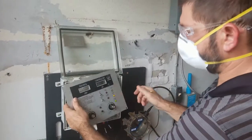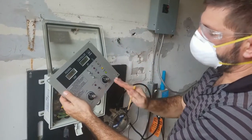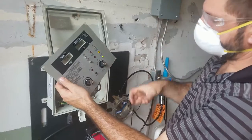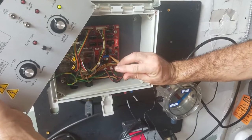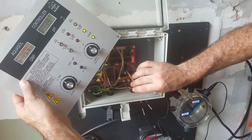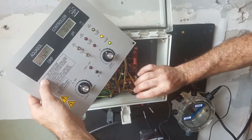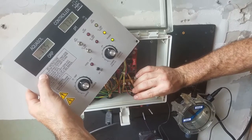The first thing we're going to want to do is adjust our knobs to match what we tested in the pool. So if straight up and down we want to be at 7.5 pH, that means a little bit higher here would be our 7.7. So then we're going to go into our potentiometer — the one on the right side is for the acid — and we're going to start slowly adjusting that with our tool until the pH feed light engages. So that's our sweet spot, or our set point.